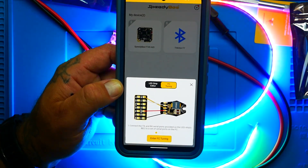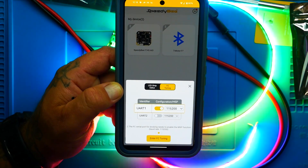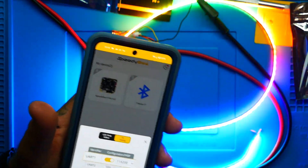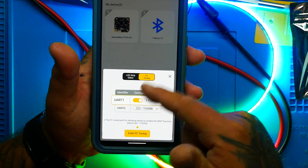Now I've got two options: LED strip editor or flight controller tuning. For the Bluetooth tuning, take your RX to TX and TX to RX, jump into Betaflight and set up a UART. Go to your ports tab, select the UART you picked — if you picked UART 1 go to ports and set that up; if you used RX2/TX2, select MSP on UART 2. Check the 'Configure MSP' button on, and you're done. If you have any questions, jump in the comments.